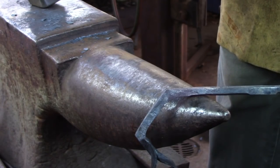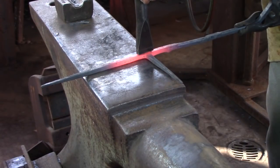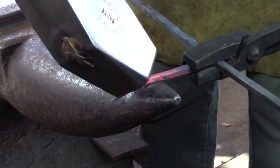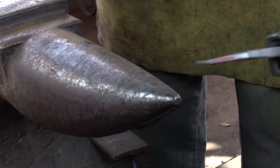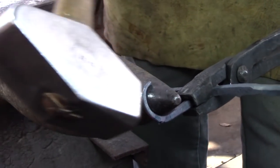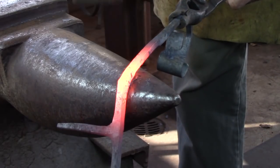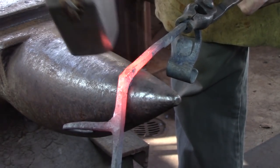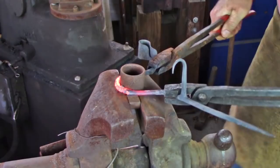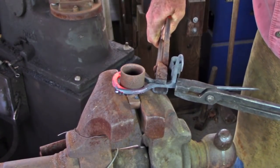Give the candle cup and the corner a good brush. To be fair to collectors, stamp the candle holder so it's not confused with antiquity. Turn the hook away from the peaks for the corners so it goes to the outside of the piece. Once you've got the hook where you like it, turn your attention to corner number one — bend that to 130 degrees or so and sharpen up the corner. At this stage you've finished your forging. Bend the eye around a piece of pipe or over the bic to complete the miner's candlestick. You may need to tweak the eye a little bit with some scrolling wrenches, but you're nearly done.